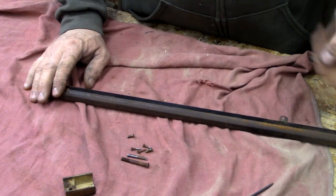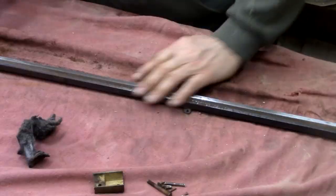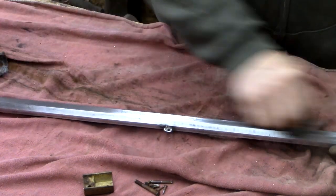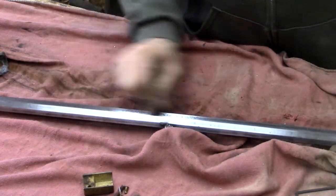We're going to clean the barrel out and clean it up, then get started on the stock. I don't see any pitting, but it was under pretty heavy neglect. I'm going to take some steel wool and just go over it and polish it up. Day one is done — 180 grit sandpaper on the outside knocked all that rust down. I took the steel wool and buffed it down even more. The barrel is now completely filled with PB Blaster, and I'm going to let it set a bit, dump it out, and run a brush through. I'm really hoping it's not pitted so I have a shootable barrel. On the upside, the barrel was not loaded — the gun was not loaded. I was very thankful for that.